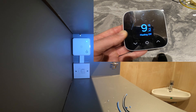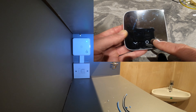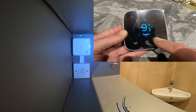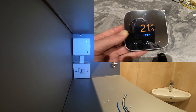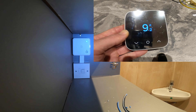Now we're paired, we need to test the system. The easiest way is to turn the thermostat up and put a load on the boiler, so it'll send a switch signal now. We should see the green light come on on the bottom right of the receiver once we get a target temperature higher. This is a standalone system, we've not got the Hive Hub. We're going to do another video where we add the Hive Hub just to make it a full smart thermostat where we can control it on our phone. But now we'll be looking for the boiler to check that we've got a flame in the corner of the boiler display, so we know it's giving it the signal that we need.